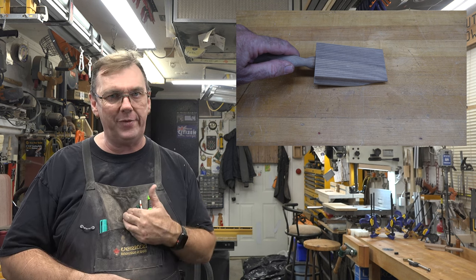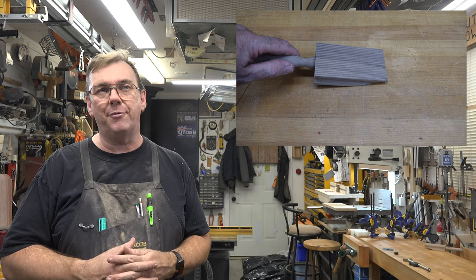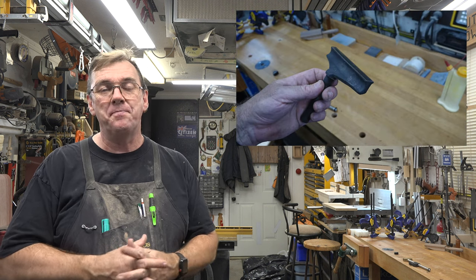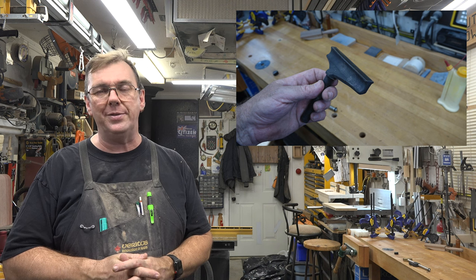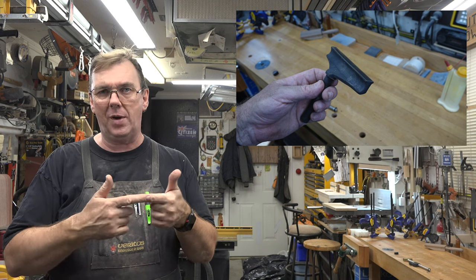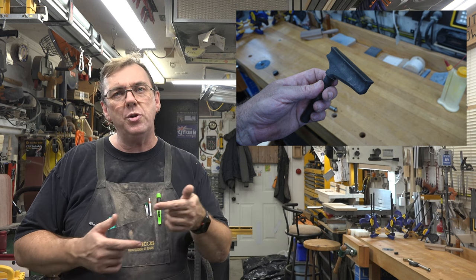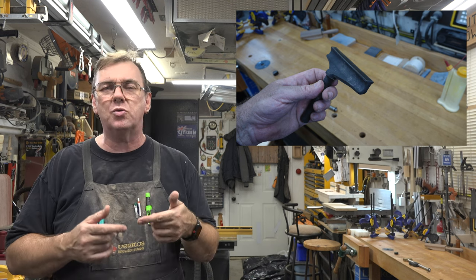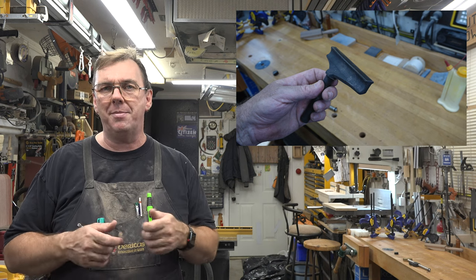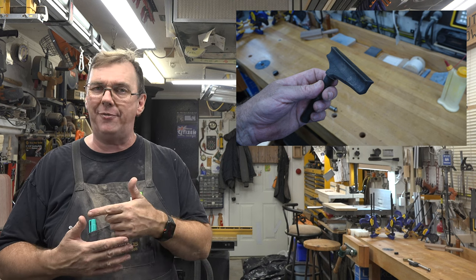That is a feature of my own design. And my inspiration came for those kind of routed out grooves from this. Guys, this is a tool rest for a lathe. And have you ever noticed that cove that's on the front end of that? That is a finger rest where the back of your index finger jams up in there. And that is where you ride your finger to give you the control of the chisel for your depth of cut. Do you think that you just do it automatically, just faking it, getting in and out? No, you guide it along in that finger groove.